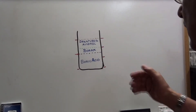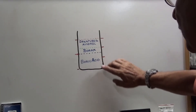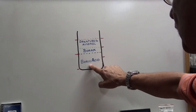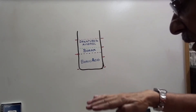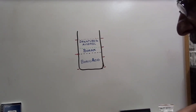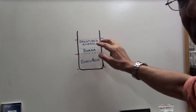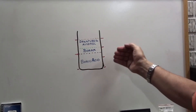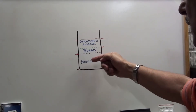There are a lot of people who get mixed up between boric acid and borax. Boric acid is what gives you that surface barrier on top of the piece you're working on — it coats the surface from the oxygen getting through. The borax is basically a flux — it acts as flux. That's the difference between boric acid and borax.